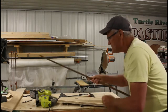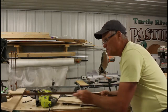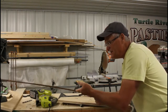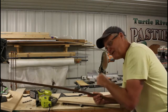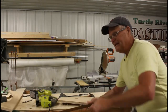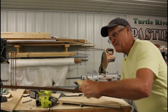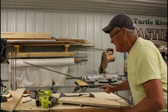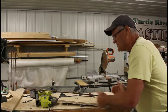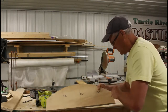I used as a batten this channel that goes between pieces of paneling that you put on the wall. The nice thing about this when you're working by yourself is that you can drill some holes through this slot and use finishing nails. You can pound that batten in and sweep that arc without needing an assistant. A nice flexible yardstick also works well to sweep that arc — you can just pound little brads on each side and hold it in place, or have an assistant hold it and sweep the arc. The main thing is to get a nice smooth arc at your measurements.